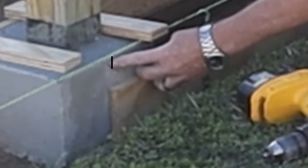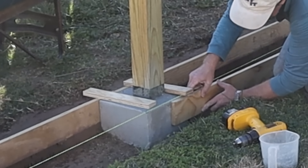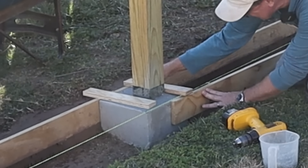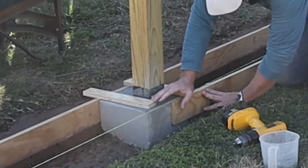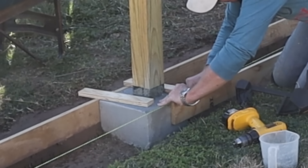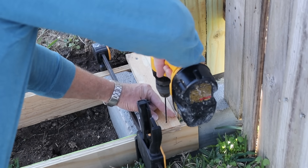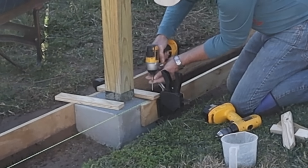Each one of these blocks has a five-inch center mark. I want my board at least a half inch to the side of the line. I'm clamping these so they pull tight against this side, and then when I screw this down in here, it'll hold it tight and hold it up to the level I need. I'm pre-drilling holes because if I don't, it will split the plywood. I'm just using inch-and-five-eighths deck screws, or exterior screws.